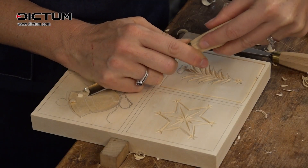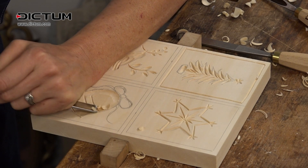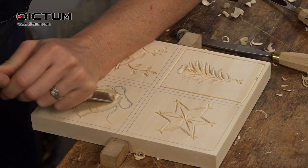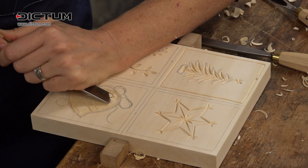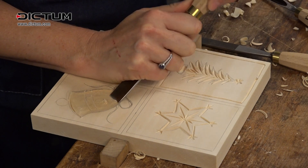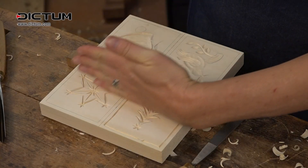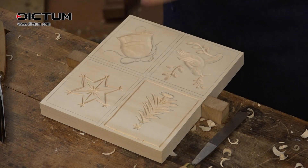Let's go ahead and go along the outer edges so that the edges are defined a little more solidly, and take that surface down again. Now, if you get caught with the grain direction doing something very mysterious — which happens with wood carving — the best thing to do is come across the grain. The grain is very difficult to see on basswood, but sometimes just going across the grain gets you in control of it.